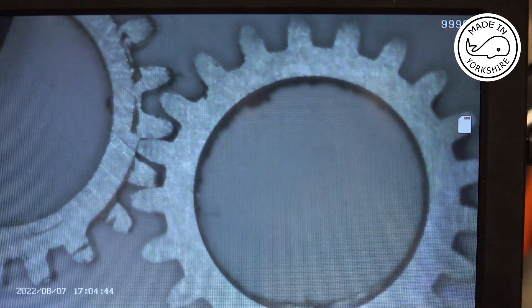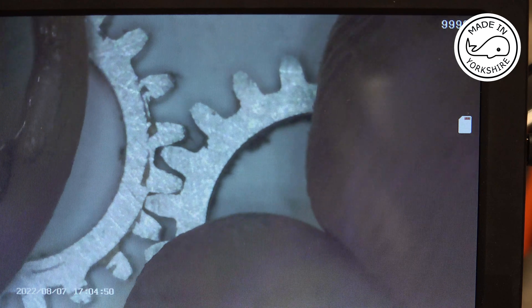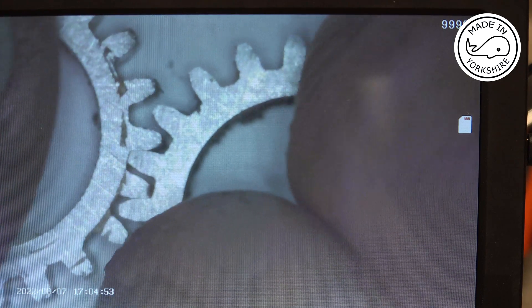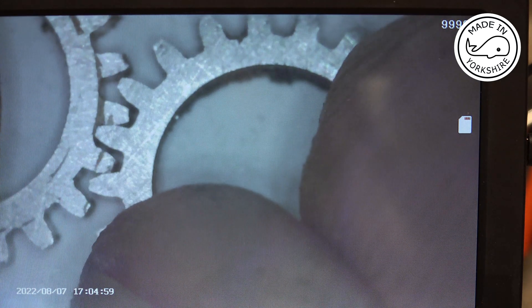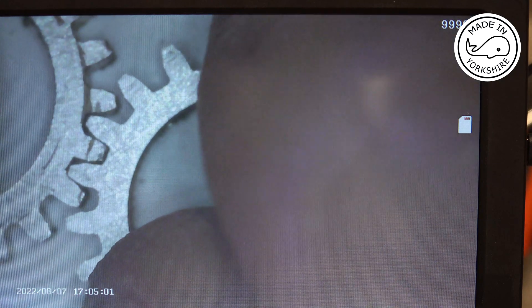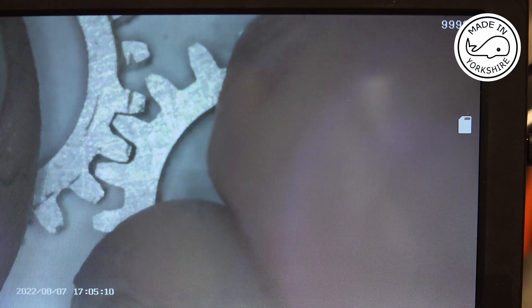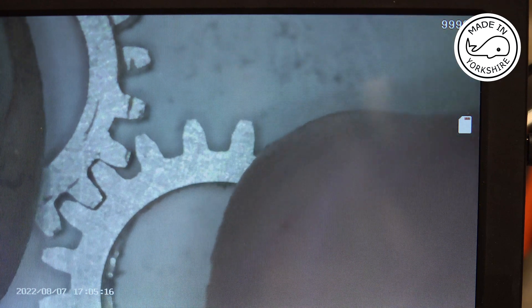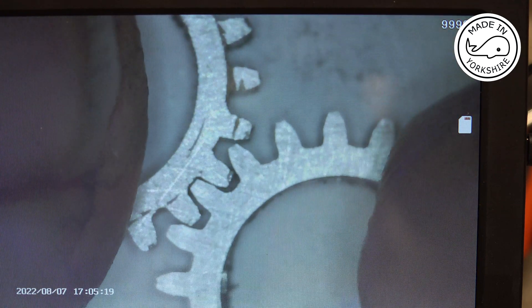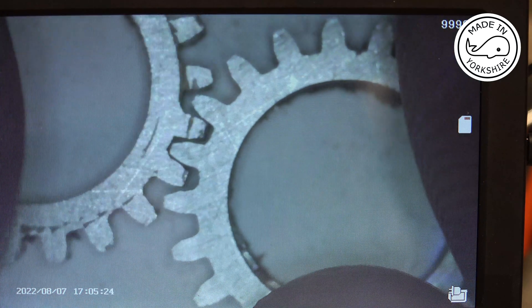This is another gear I've just cut on the hob, and there's just a little bit of wiggle room there, so it's not 100% perfect. I did check the depth of cut — I didn't go beyond 45 thou; in fact I probably went just a touch under. It doesn't seem too bad though.